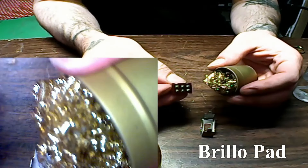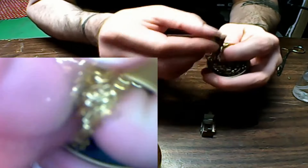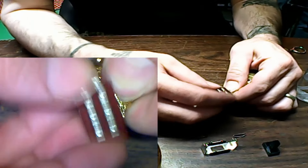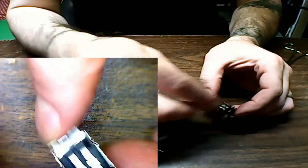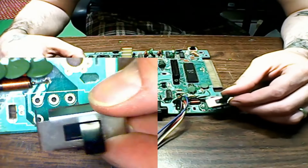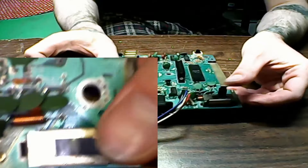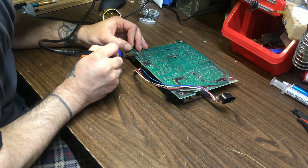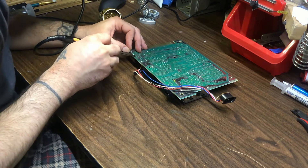And then I grab my soldering tip cleaner — or you could use a Brillo pad, doesn't matter. The contact pins are back in. Put the rocker in. Snap. Now it's time to put the socket back in. Look how I cleaned up the work site there before putting it back in — got all the old solder off. Action feels good. Going to just add some fresh clean solder, heat it up, and solder it back into place. Now it's time to test it out and see if it works.